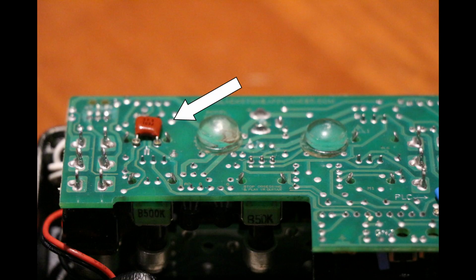So today I thought I would delve a little bit deeper into this pedal and swap some of the capacitors around to see what difference they make on the overall sound of the pedal. So I'm going to stick to the capacitor values that Jon recommends in the manual. So first I'm going to leave it on the brown channel and I'm going to swap out the presence capacitors to see which I prefer on that. And then I'm going to switch over to the red channel, which is the only channel that the C11 capacitor affects. And I'm going to explore the bass sounds.